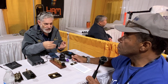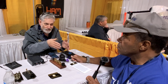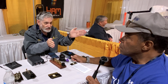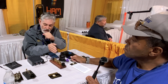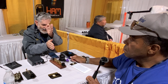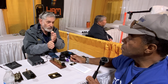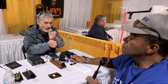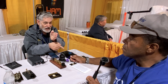To set up the box, start by adjusting the input side. When you tune your radio, you've got a sidetone frequency set — 400 Hz or 500 Hz. When you hear an input signal and want to zero beat it, you tune that input signal so it matches that sidetone frequency. So without transmitting, generate your sidetone and tune the box to center on that sidetone frequency — it's now looking at exactly that frequency where you're always going to tune somebody to zero beat them. Then when you go live, tune the incoming signal until the box hears them really well. When it goes from hearing to not hearing and back to hearing — you've zero beat them. The box is helping you zero beat.